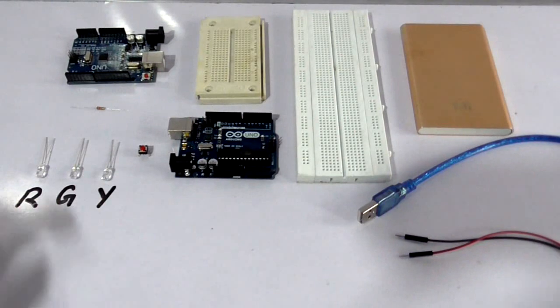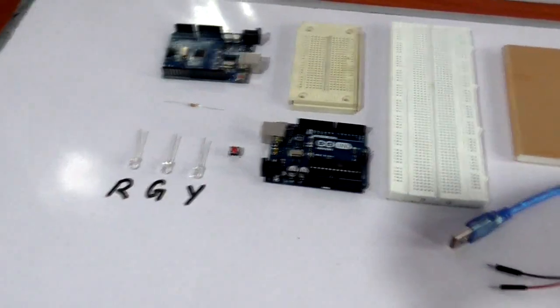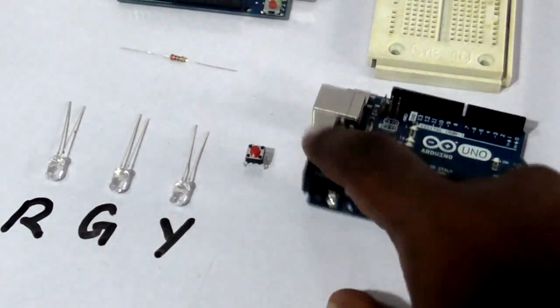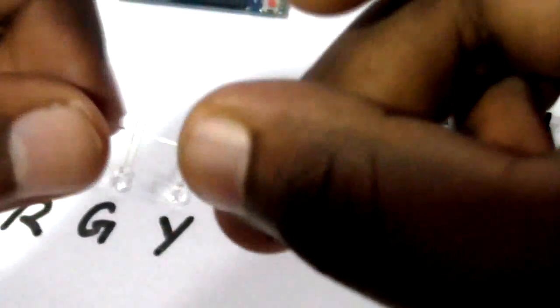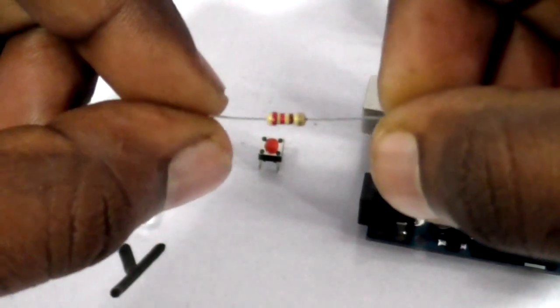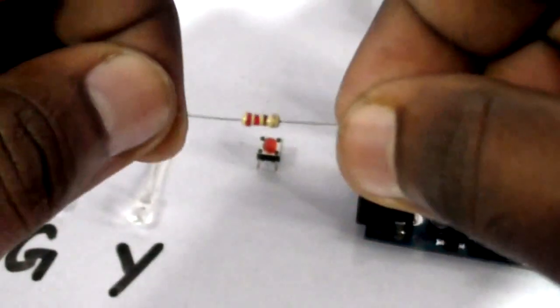If I give a closer look, I have the yellow color LED, green color LED, plus red color LED. We are going to discuss further about these LEDs later. This guy right here is the power switch — I already told you to buy some power switches. This switch has 4 pins, plus I have the push button. When I push it, it works. Plus I have the resistors — I am going to need a 220 ohm resistor. You can see the color bands — this is how resistors indicate their value. Gold color band, brown color band, and two red bands: this says 220 ohms. We are going to cover a whole lesson about how to work with resistors.